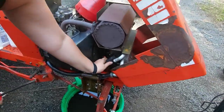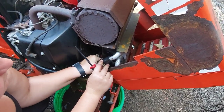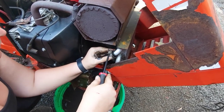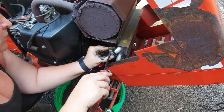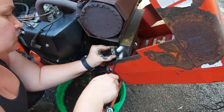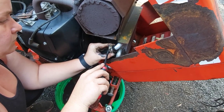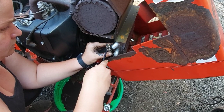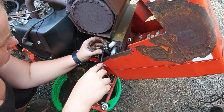That's how you do it on the newer series Ingersoll/Case tractors with a hydraulic filter. Now we're going to refill the tractor. Connect your hose back if that's the way you drained it, put your plug back in the travel control valve if that's the way you drained it, or whatever method you used. We're going to put our top hose back on. You don't want the clamps all the way at the end, but you don't want them too far down either - about a quarter to three-eighths of an inch is plenty. Don't want them too loose or too tight. Once they start grabbing, a few full turns is good - you don't want the hose to push through the worm gear slots, but you want it to be pretty tight.